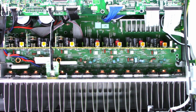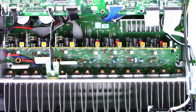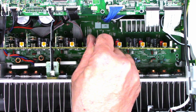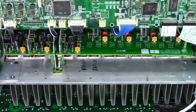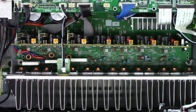I did an initial sweep with the acid brush, just dry. Now I'm going to go ahead and hit it with the acid brush and some acetone. It looks much, much better. I just noticed there are numbers written on the heat sink — A1695 and C4468. So I'm thinking maybe these two output transistors have been replaced already. I could certainly see moisture causing an overcurrent condition on these output transistors.